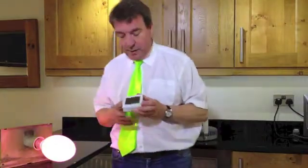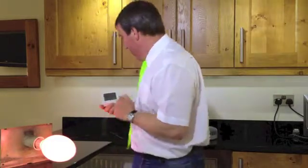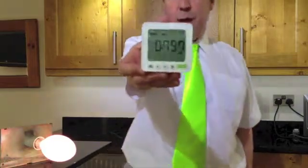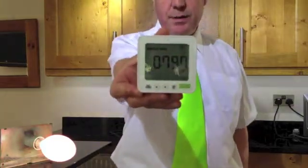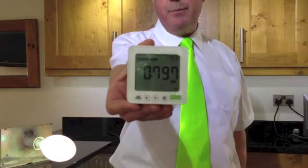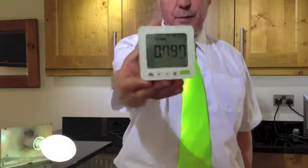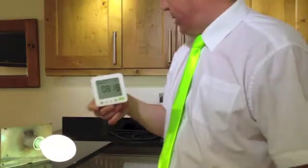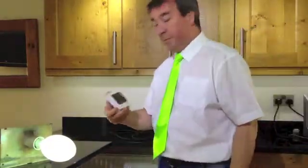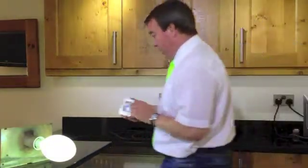So this is your typical high bay. As you can see it's warming up there and at the moment it's not showing anything on the meter, so I'll press the button. There you can see 797 watts being burned by this high bay lamp. Now I'll leave that running because as it gets warm and starts giving out bright white light it gets better. It's actually 818 watts at the moment.